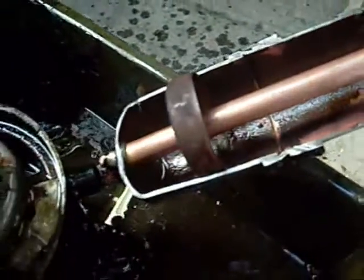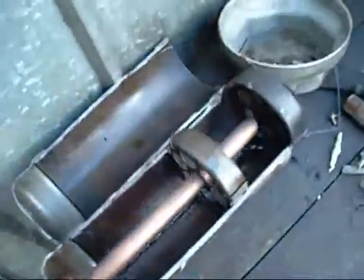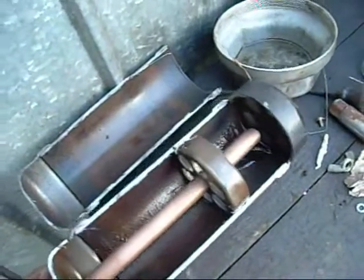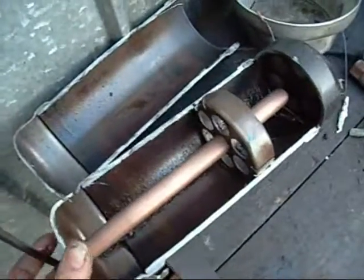I thought this Mitsubishi unit would actually have a filtered dryer in it, but there's actually two accumulators. This is the second one, which is for catching excess refrigerant liquid when it's running in reverse cycle. The single cycle models don't actually have this second accumulator.